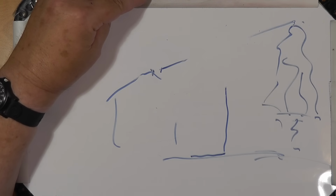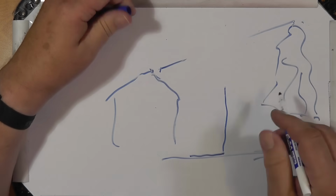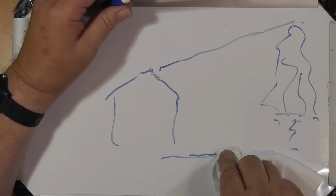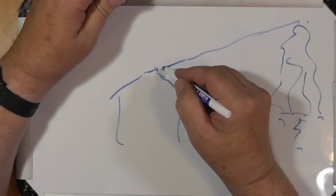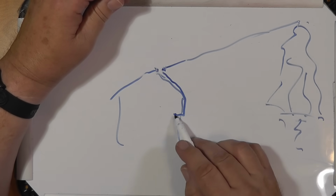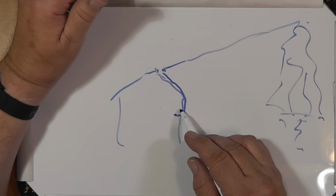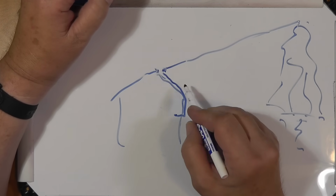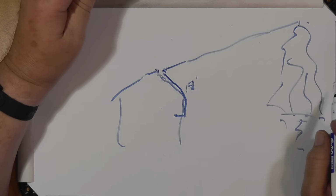The other possibility is that it's end fed. Okay. And I don't think MFJ makes one of those either, but then it would be fed from there and you could take your 18 feet down into a second floor. Okay. 18 feet, that bothers me. That just seems way too short for the coax.